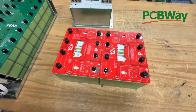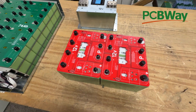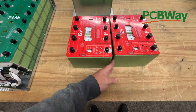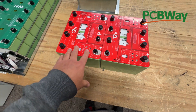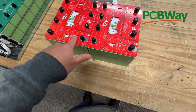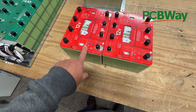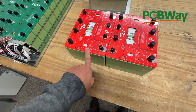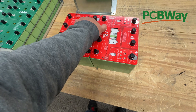This is the one we're going to make today. Eventually we're going to make all of them — people have requested it. Today I'm going to show you how to combine two of these right here to make one single eight-cell 12-volt battery with twice the capacity. This one is 74 amp hours, so now we're going to have 148 amp hours — and not 600 amps but 1200 amps. It's going to require some ingenuity on our part.